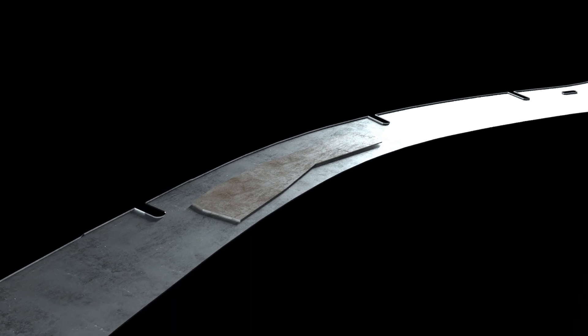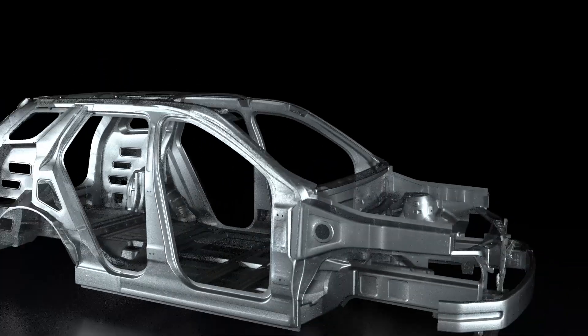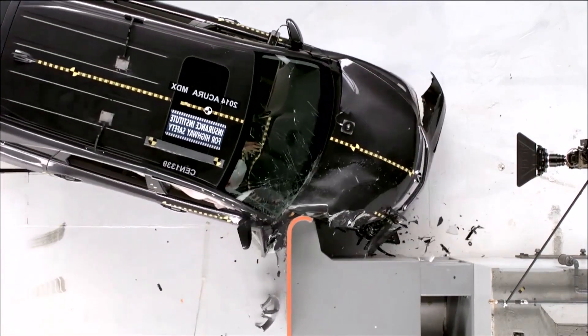The patch is a piece of steel which is welded directly onto the blank before stamping. It reinforces a specific area of the final component, allowing OEMs to improve a vehicle's crash performance cost effectively.